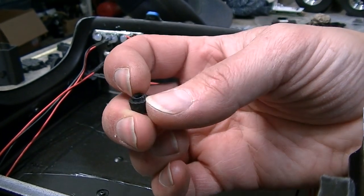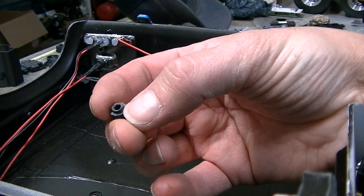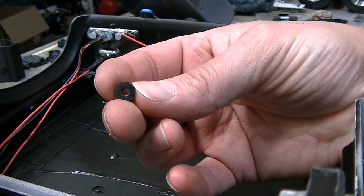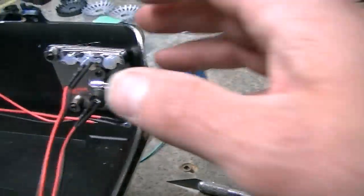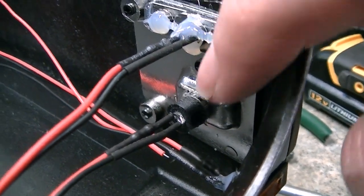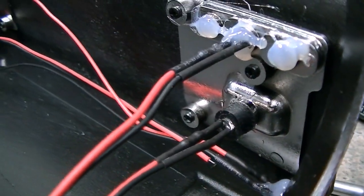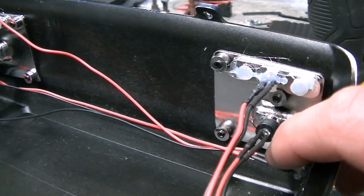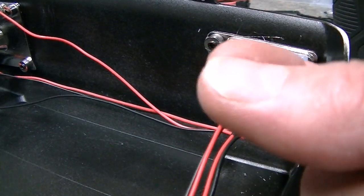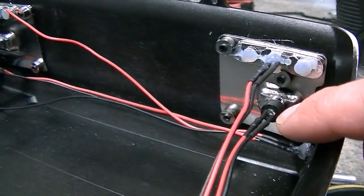This little bump on top just sticks into the socket hole, right where the 5mm LED base would have sat in the light socket. Then there's a 3mm hole on the end and the LED just goes right in there — that's all it is, no more complicated than that. So we've got the socket on the back of the light, then the little black adapter, and the 3mm LED in there. I also sanded off the round ball end of the LED so it's flat straight across, which dulls out the warm whites a bit.